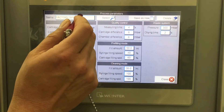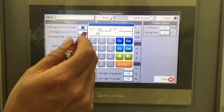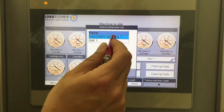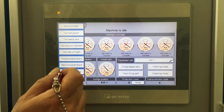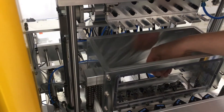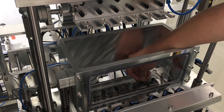More than 100 different parameter sets can be stored in the PLC for different ink qualities, and the operator can easily load the required machine setup. Several built-in self-test sequences can be activated to diagnose possible malfunctions, like testing the vacuuming path shown here in the video.